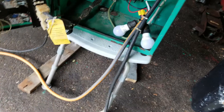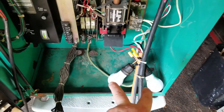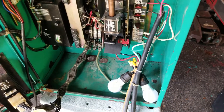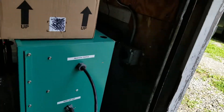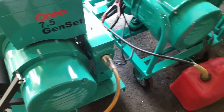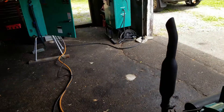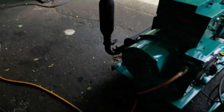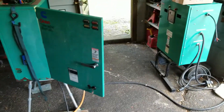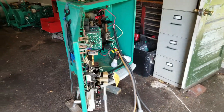I just bolted in the motherboard and wired everything up. I have all this stuff temporarily wired — we got two light bulbs, one for each side, because it's going into 240 volts, split 120/120 on two legs. We're going to plug it into my MIG welder outlet to simulate line voltage, and we got two other wires that go to the generator. We're going to use the 7.5 gasoline generator today, although this transfer switch can be used for diesel as well. I got this all plugged in to sense if this thing's picking up voltage.